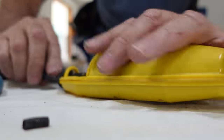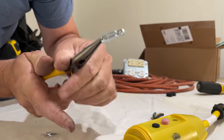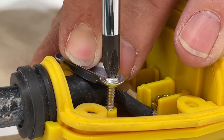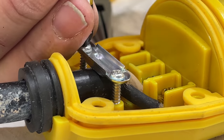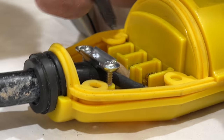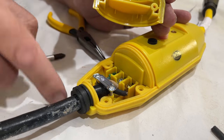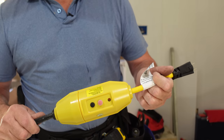Now let's attach the little clamping plate. You wouldn't want to put it with the sharp edge against the cable — it goes this way where these two ridges clamp down on the cable. Put a screw in on each side and snug it up. I don't want to crush it, just hold the cable in place. Here's the cover — it's going to capture the gasket that goes all the way around as well as the bushing we put in place. Snap it on and we get four screws. This end is done.